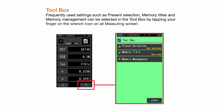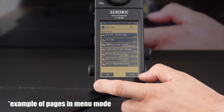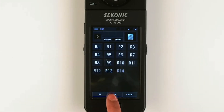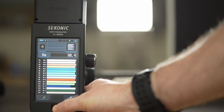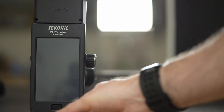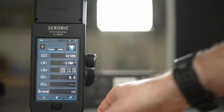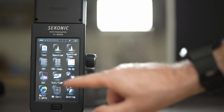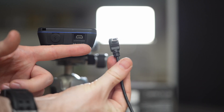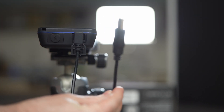Just like with the previous unit, you have five slots that you can change to show specific results. We have suggested to Sekonic that they include the option to add pages so you can see more than five results quickly, especially since there are now a lot more of them — the only option to see them all is to constantly switch icons or download the info to a computer. It's also worth noting that both the C700 and C800 use resistive touch displays, which can be used with gloves and may be more resistant to dust and water spray, but are less touch-sensitive. We find ourselves having to re-click icons from time to time. If this happens to you, try using your fingernail. The C800 also kept the outdated mini-USB connection, and at this point we would really like to see USB-C and even some sort of wireless connectivity.